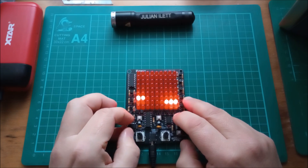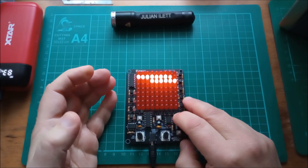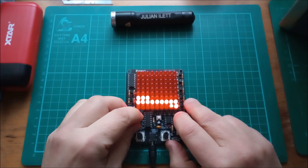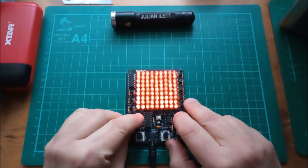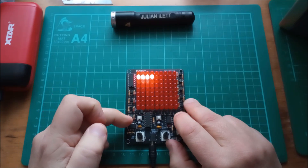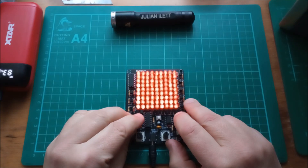In this mode, the Y oscillator does nothing and the switched capacitor does nothing, so it's all working on the X oscillator. We can speed that up — and all it is is a raster. I'm seeing that as a smooth raster; you're seeing it as a kind of broken-up raster. Incidentally, if I press this capacitor selector switch and put it halfway between the two, you get no capacitor — the 555 runs flat out, which is about half a megahertz. And you get essentially a LED tester which shows that all my LEDs are working.